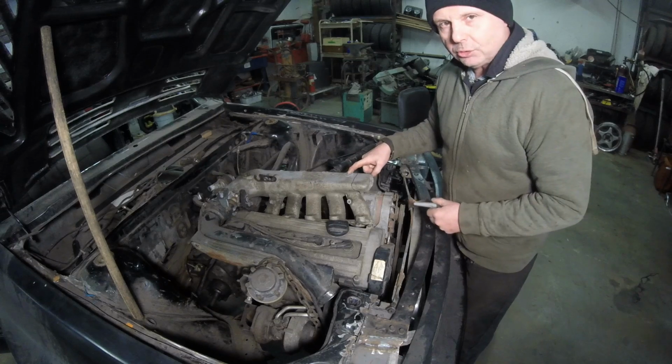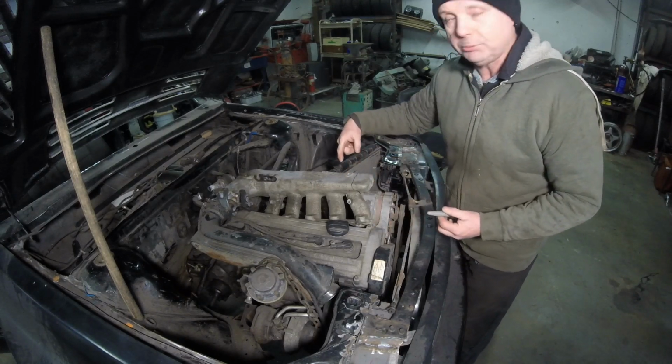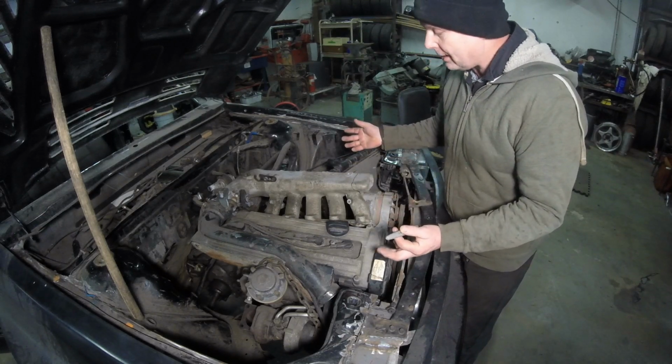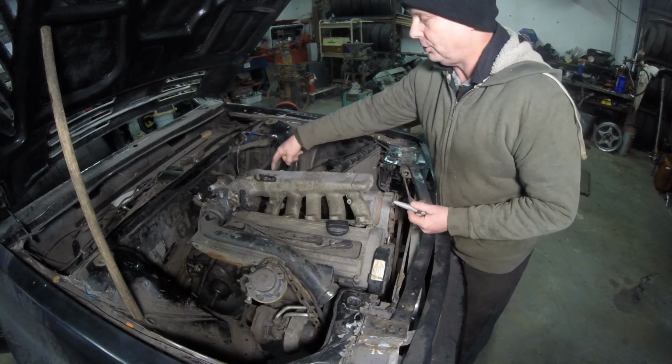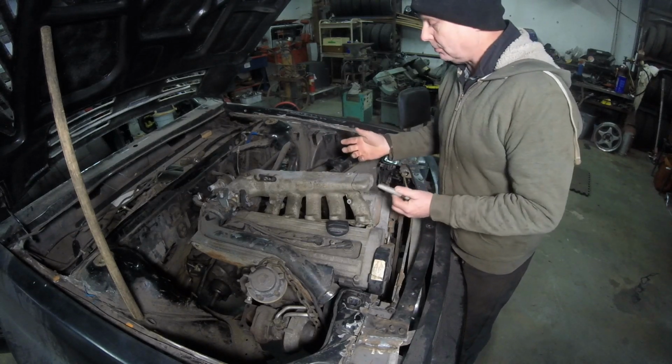How did they make these holes? Well, I've never opened up a manifold, but they had to have cast tubes all the way through this so boost, or air pressure, would not be leaking out. I'm going to get rid of all those tubes, and I'm going to seal up the holes by welding them up. That's my main thing.